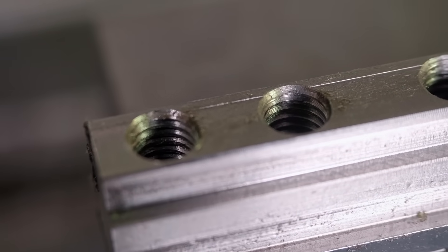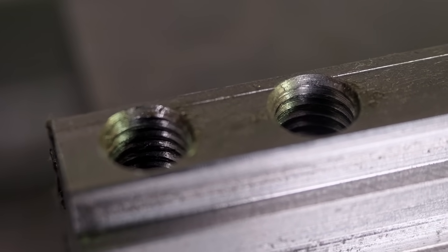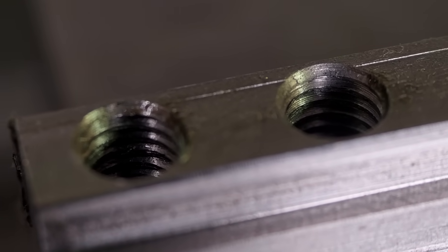Well that has worked way better than I could have hoped. Those threads look pretty much unscathed. It doesn't even seem like the thread which the tap was broken off in is significantly damaged. I must say Stefan, thanks very much for that method — I'm sure I'm going to need it in the future. And special bonus: the four millimeter mill didn't even get trashed doing it. So that was brilliant. Thanks a lot for watching.